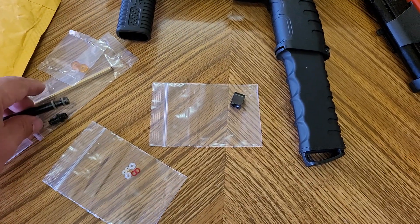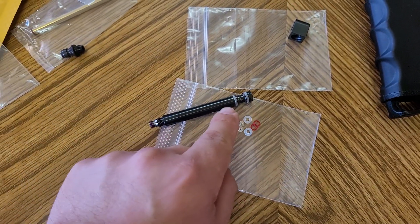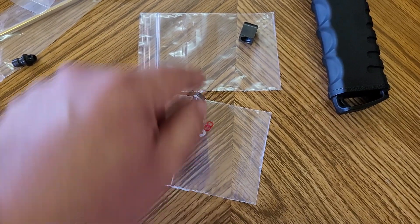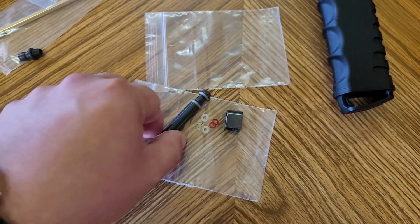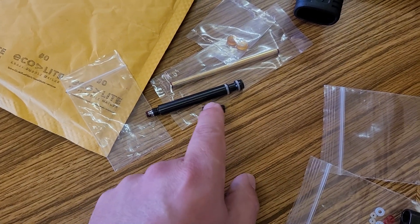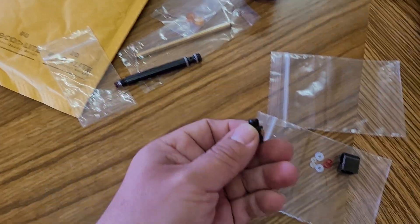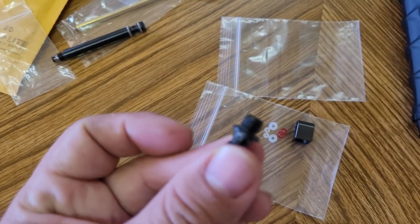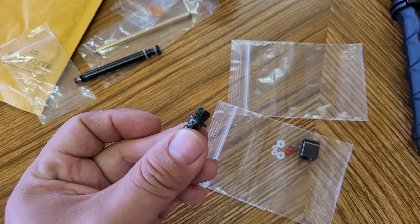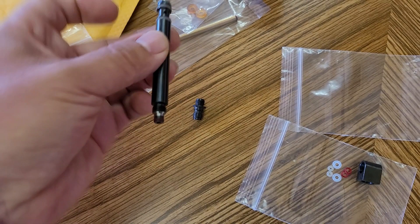What I bought from Tippmann Parts was all these random little O-rings — I put three of them on here — plus the swivel piece. Then I went to PB Sports and they had the quick disconnect that fits these threads. This isn't a normal thread; I had to measure it, and it's not one-eighth NPT — it looks like a metric thread, pretty fine. This piece from PB Sports was also there.